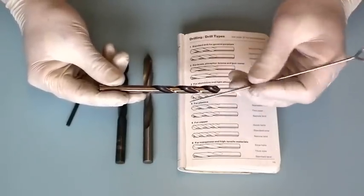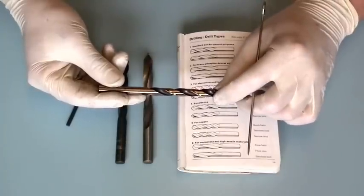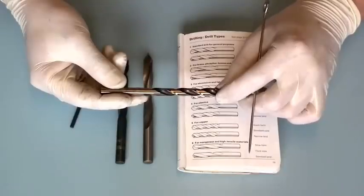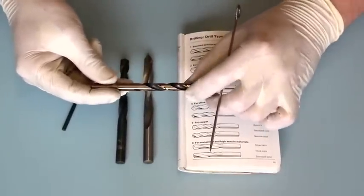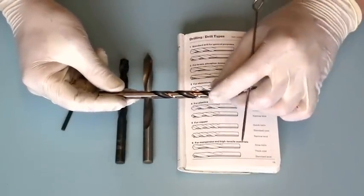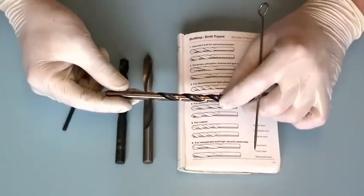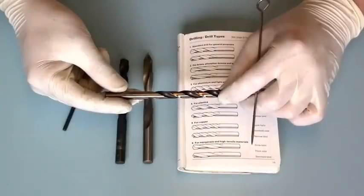The problem with using a brand new razor sharp jobber drill, because you're drilling into a pre-existing hole and you haven't got to push it down to force it through the metal, it has a tendency to snatch and pull. It wants to spiral its way in, and with a small drill you can end up snapping the tip of the drill off and getting it stuck. This is particularly the case in brass. Brass seems to be a material that's fairly bad for that.